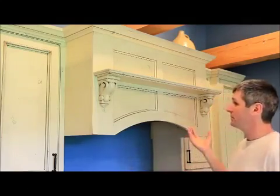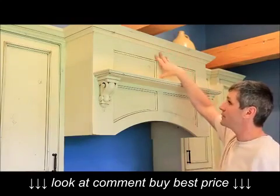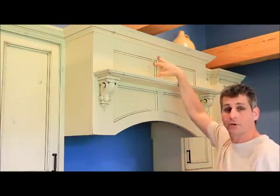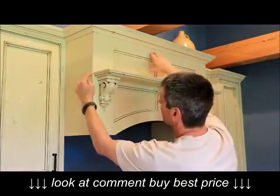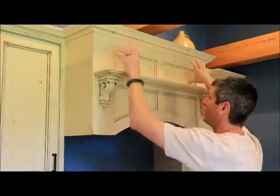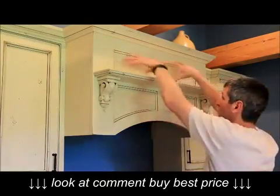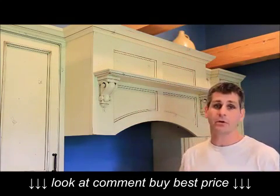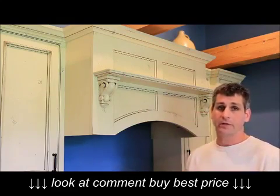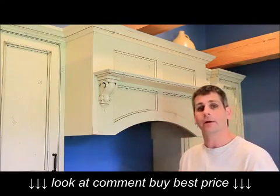To make your connections, a lot of folks are concerned because they can't get up inside the range hood. One of the options Stacey and Conestoga offer for $250 extra is a removable panel, which will result in a seam right here because this panel snaps on — it's not put on until you've made your ductwork connections inside the hood, and then you snap it on. We didn't need that here because we could work through the top, but it's something to think about. If you're going tight to your ceiling, your HVAC guy will thank you — he can just pop the panel off and pop it back on.